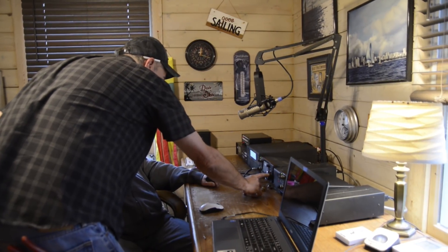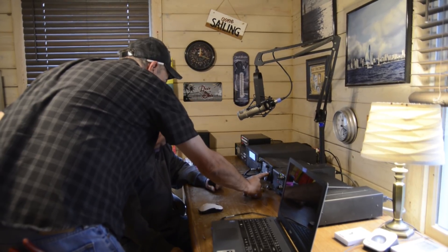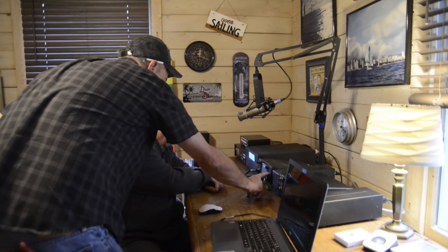Lower is longer, so you just need to cut some off of it. If I want it resonant at 9.5, it's fine at 9.5 with a 1.3 SWR — I have no problem with that. What I'm getting at is I like the idea of being able to work below 3.95, up below 3.8, so I can do DX — that's about right where I need it. You can get 3775, so you're in the DX window right there.